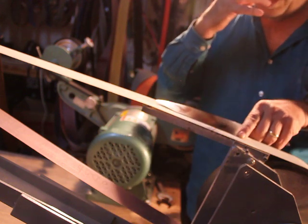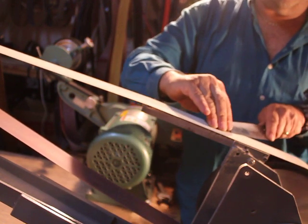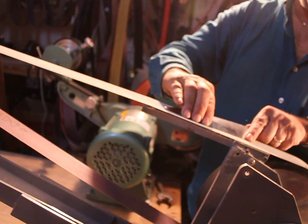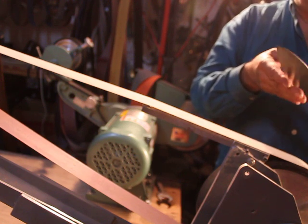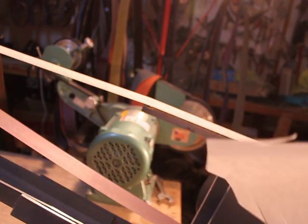This is a very important technique for single-beveled knives. I wouldn't risk doing this other than by hand except on a belt grinder with variable speed control and enough torque. Even at a lower speed — right at about 300 RPM — you set things up, both hands on, and if I put a lot of pressure on it doesn't slow down a bit because I've got all the torque in the world to work with. I happen to be using a custom-made A3 belt for a two-by-72 grinder.